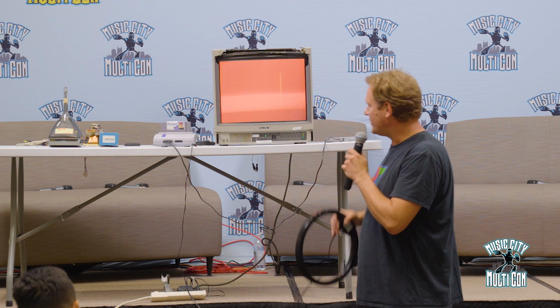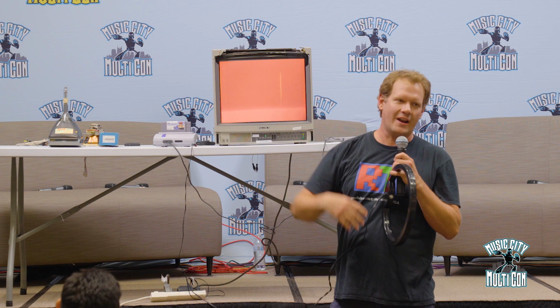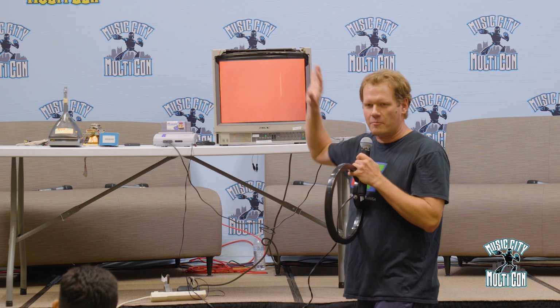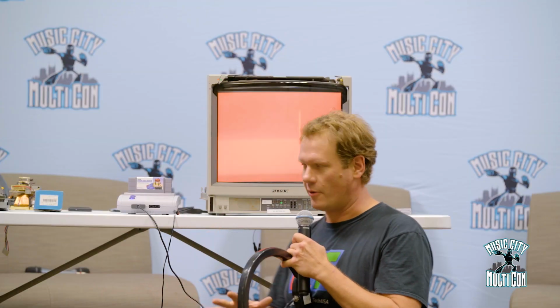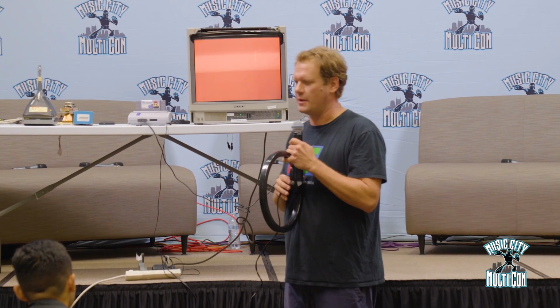But what this does is if we get some magnetic interference on this tube, it's very hard to get that off and clear it up. Now, a lot of these will have an automatic degausser. And that's what you hear at the beginning when you turn the TV on, and sometimes you hear that bong, gong sound. That is the internal degausser going off, and it's trying to balance that magnetism, but it is not usually powerful enough to get rid of outside magnetism.